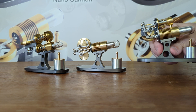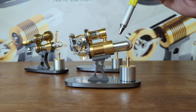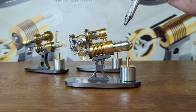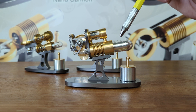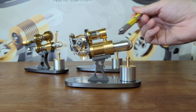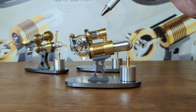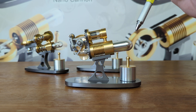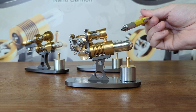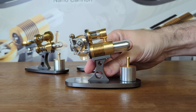Let's start with the gamma style Stirling engine, which is arguably the most common. You have two pistons, but on this one, the displacer piston which shuttles the air between the hot and cold side — the actual piston doesn't touch the outside of the wall. It's effectively in this case some aluminium that moves between the two sides and forces the air to go from the cold to the hot side. There's a little pipe here which, as the air inside expands, pushes the power piston which drives the flywheel and the whole mechanism. So that's a gamma style Stirling engine.